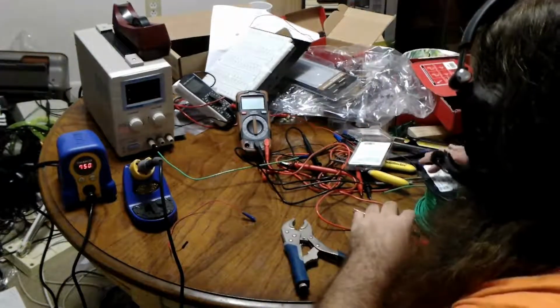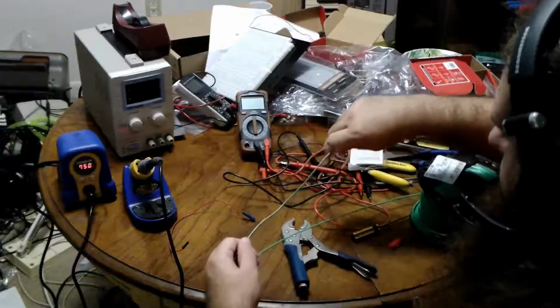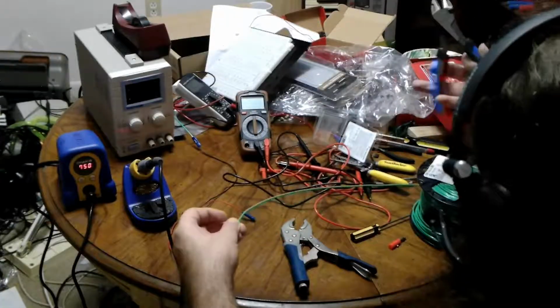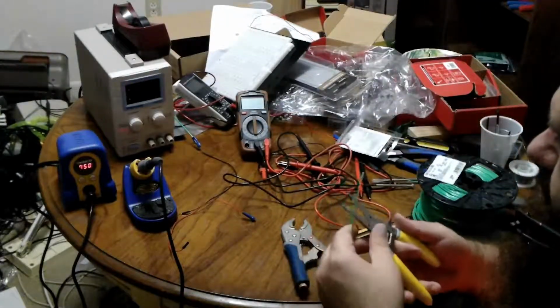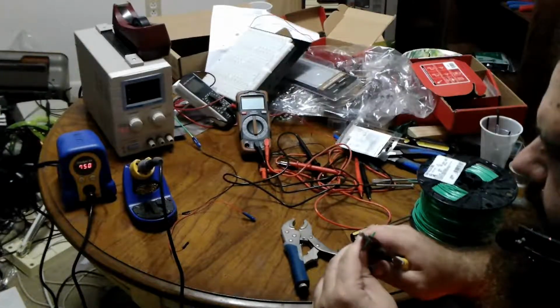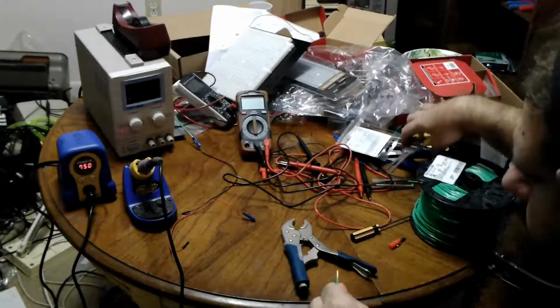So now I will cut another length of this wire. I suppose I should try to make it roughly equal. I'll take the other one out, put it about there. All right, put you over there. It's not going to matter too much. And we know this is 14. Remember, on your strippers, solid and stranded are different settings. This is a solid wire, which is easier to work with, but stranded has its uses.